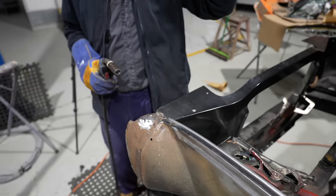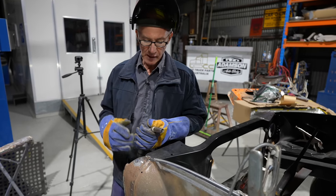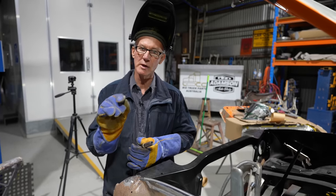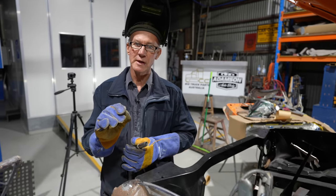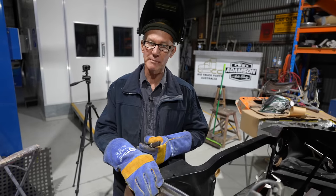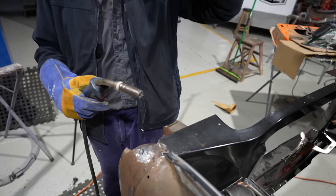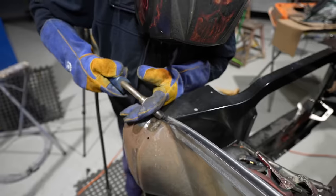And believe it or not, sometimes you'll look at that and think, oh, that's a bit ugly, that's a bit much. But if you know how to use one of these things really good, it can work to your advantage because you've got a nice gap that you can lay a weld in there and the penetration's spot on. It spreads, whereas sometimes you can have virtually nil gap or no gap, and it's sometimes not as good as having a bigger gap. Yeah, so that's good for a TIG. Yeah, it is. So different configurations, different gear. But anyway, we'll spot this in here.